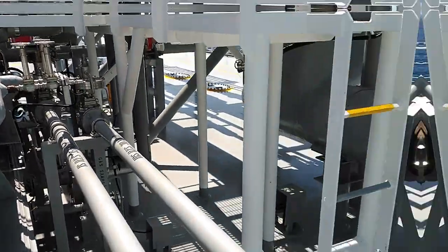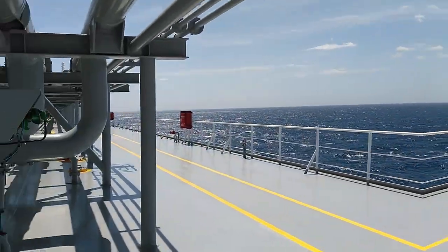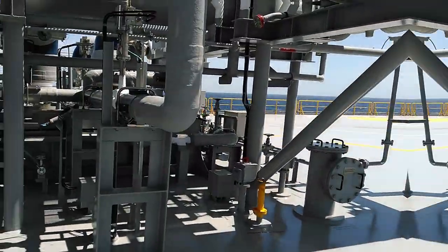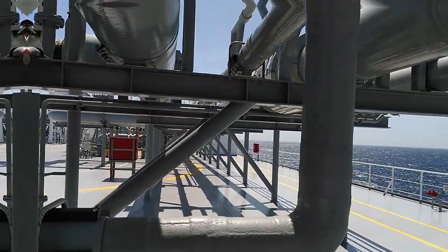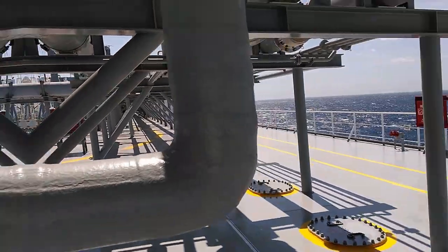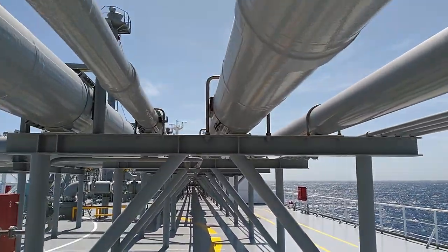The valves are for the starboard and port side nozzle, which we don't need now because we are not cooling down this tank — it already has LNG inside and is still cold; it will be cooled down later. On the left is the master spray valve, which distributes the LNG on the spray line. On the right is the spray line filter nozzles, in case it gets clogged from any residues remaining inside the LNG — you can remove and clean them.